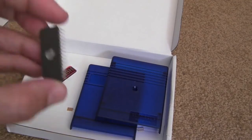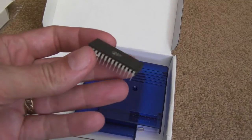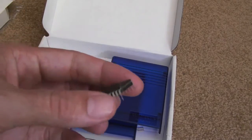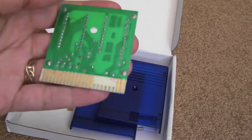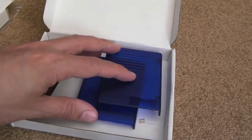The idea was to use an EEPROM on there. I think this is 4 times the size, so this is a 32K EEPROM. I was going to have the diagnostics on one side and another game on the other, with a switch to toggle between the two. But as I mentioned, the connections are missing off the bottom there for the upper address lines. Can't go beyond 8K anywhere, I don't think. So that's why I decided to look for alternatives and found this flash cart.